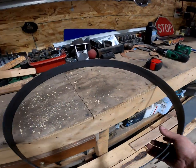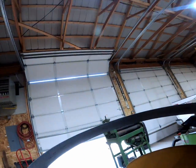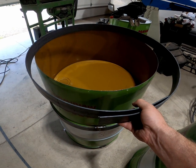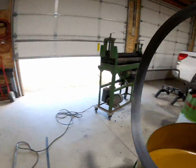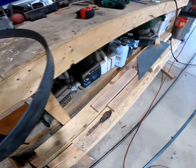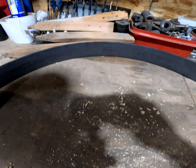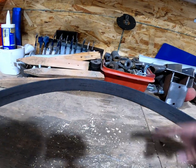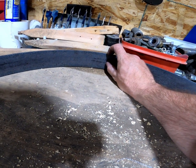I'm gonna get this one cut. So this is my upper ring. This one's gonna go up here on the top. Then I'm gonna put my grate inside of this. Essentially what's gonna happen too is this is 2-inch wide. And then I got this other stick of 1-inch. So I'm gonna put that 1-inch, that's gonna be my grating coming across this way to make the top of my table so my sparks can go through it. And I'm gonna put it on the top.